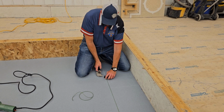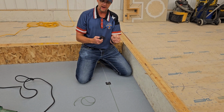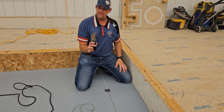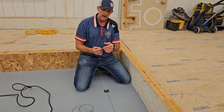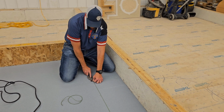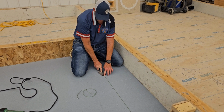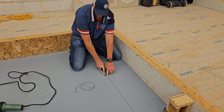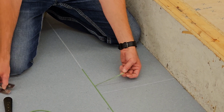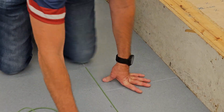So, we place the plate over the weld, centered, and the spatula knife has a bevel. You can skive with the bevel down or the bevel up. I prefer the bevel down. You put your skive knife in the slots of the plate and give it a push. Now I have half this weld skived, and I will go ahead and cut off that half skived weld.